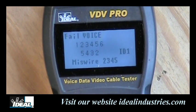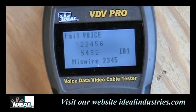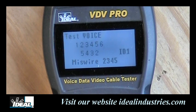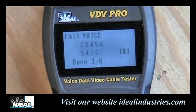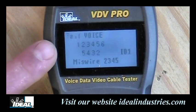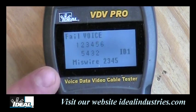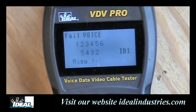And when, again, you look at older telephone lines or older phones themselves, old analog phones, in many cases, we had to reverse wire the patch cord. So older analog phones required that the patch cord be miswired like this. And this actually would indicate a good cable. You'll find newer digital phones are not polarity sensitive, and they wouldn't care if it was straight through wired or reverse wired. But since the tester sees a reversal here, it's going to say fail on us, okay? Plus, it sees an open in pins 1 and 6 in it, okay? But in many cases, this is actually what you'd want to see in the cabling, okay?